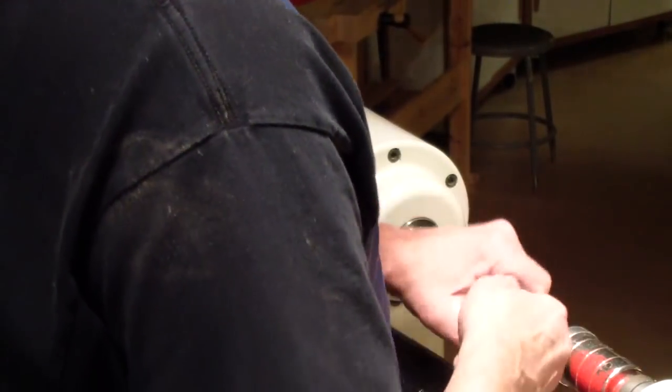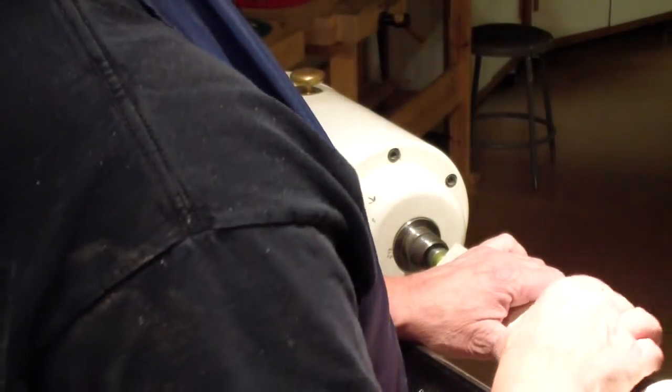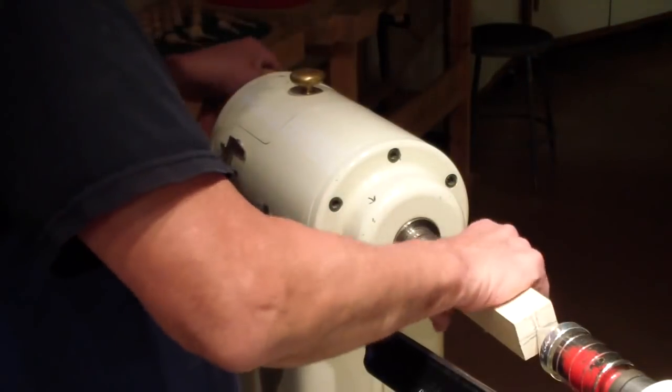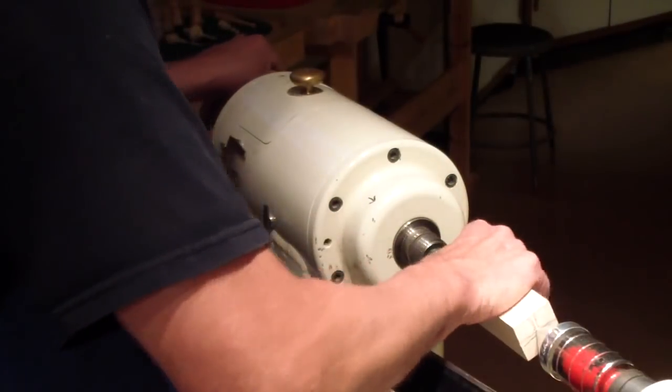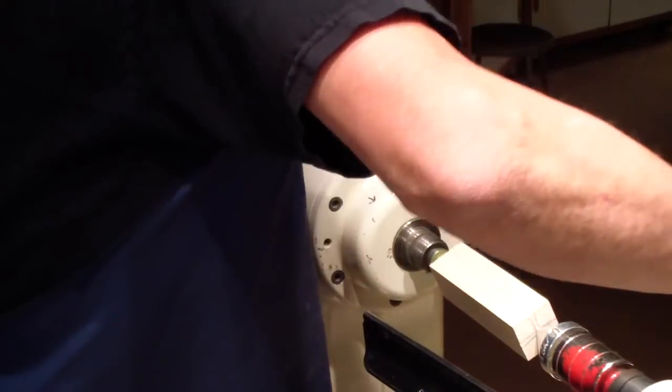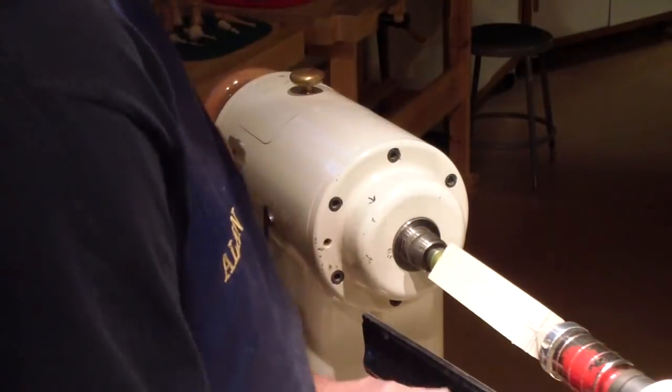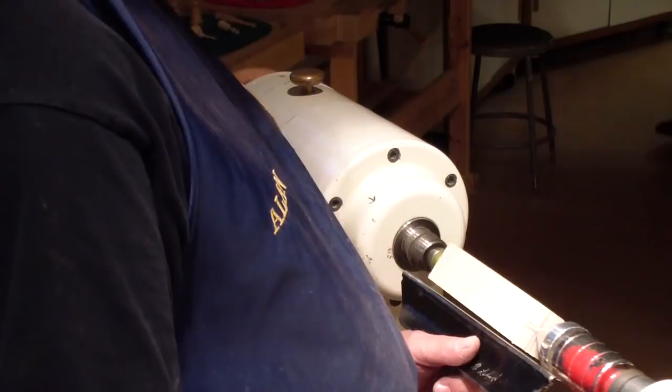This is a step center, it's a spring-loaded pin, so I have to push pressure back into it. So I like to put one thumb on my bearing center, sometimes called a live center, but it's a bearing center. And then I grab the hand wheel and wiggle my blank. If it doesn't wiggle, we tighten up. Then I lock the lathe down. And then I'll set those corners so they're parallel to the floor. That way I know where my most sticky out part is.